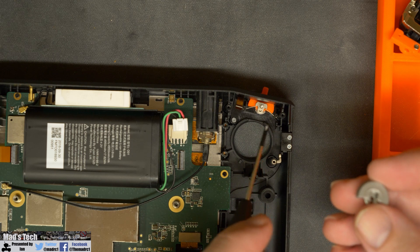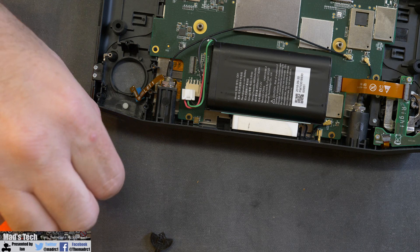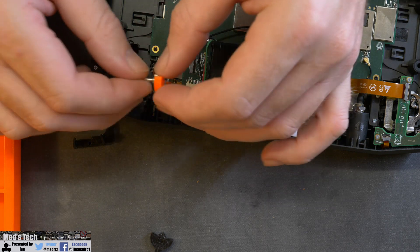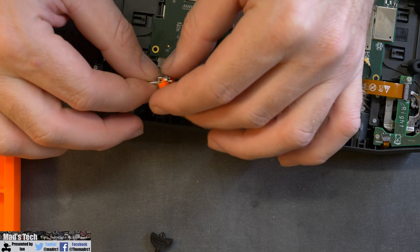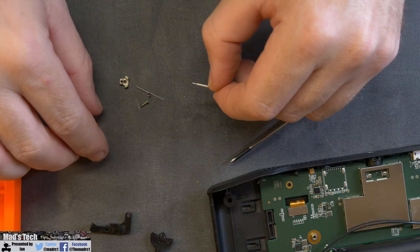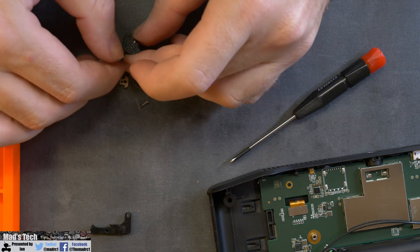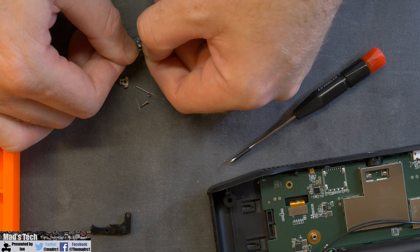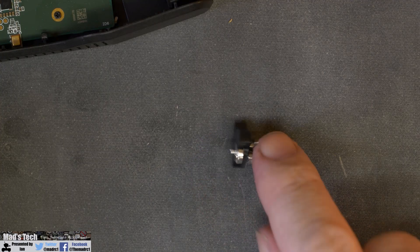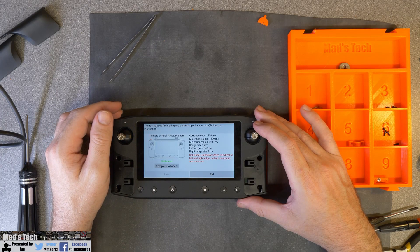The idea is to simply replace the metal wheel with the plastic one I have created. You withdraw it out of the case slowly and very carefully, remove the LED wire, and simply swap over the parts from the existing one to the new one. I had an orange test piece in place but the process is exactly the same as on the original one. You simply undo the little screw on the top, withdraw the small metal bits and the spring, and then swap everything over onto the new plastic lever. Be very careful not to break the little shaft on the end because it is extremely thin and very easy to damage — if you do, your gimbal won't work at all. Once everything is put back together, make sure you test it and confirm it is doing everything you expect.